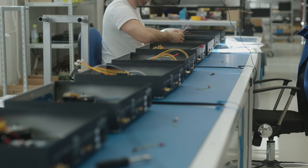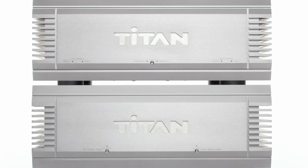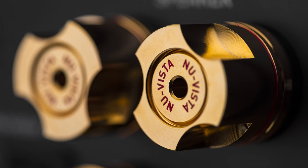For the M series the power supplies were generously rated, so it got away with the same thing. But with the Titan you could drive some really low loads — the rest of the product ranges we tested down to about one ohm, but with the Titan you could almost go down to half an ohm or less. A lot of the Titan is in the Vista, because it is my favourite way of building a power amplifier — to have the power right on its doorstep to draw immediately, rather than through a whole load of wires or PCB traces.